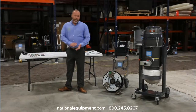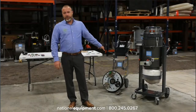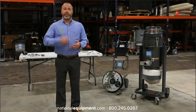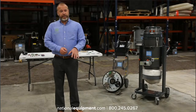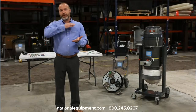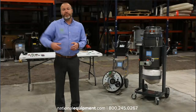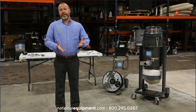We can also talk about machine speed. The Helix has a high and a low speed. The 8274-4 has variable speed. So you have the ability to control how fast that tooling is moving. When you're doing a coatings removal, slower is better. It allows the tools to get into the work. It allows the carbide tipped anything to actually cut through the material and shave it off the floor. Otherwise, you could just be spinning your tooling straight on top of it, and if we're talking about diamonds, you're probably going to glaze them, and then you're in for a bit of a headache.